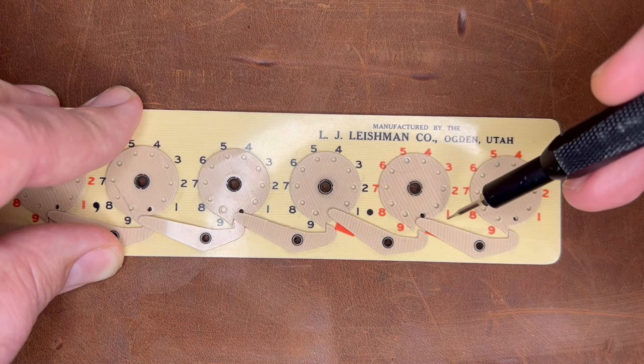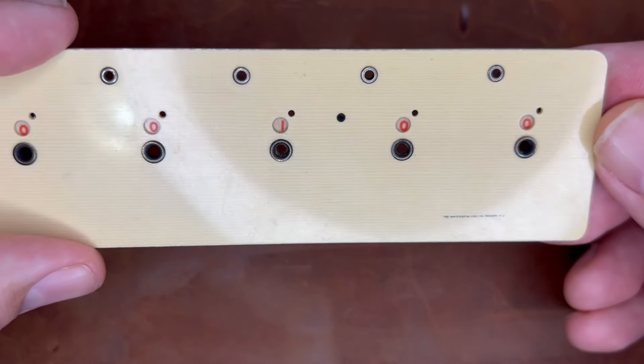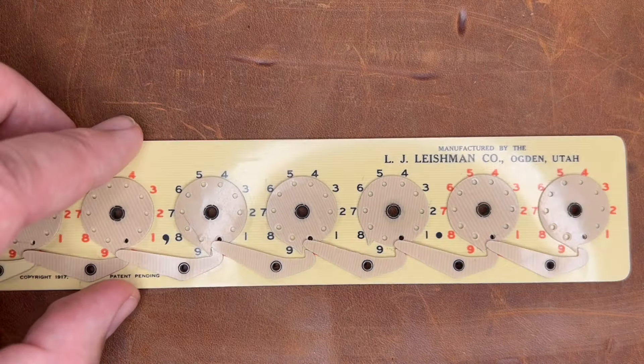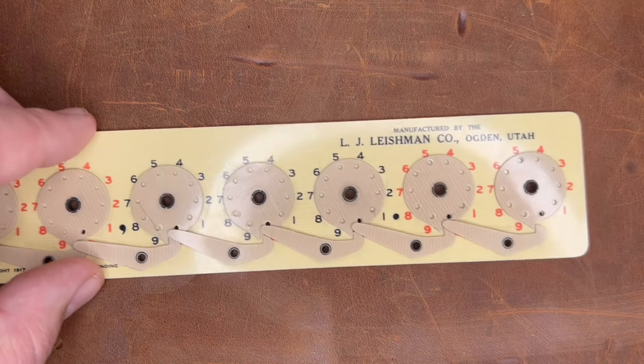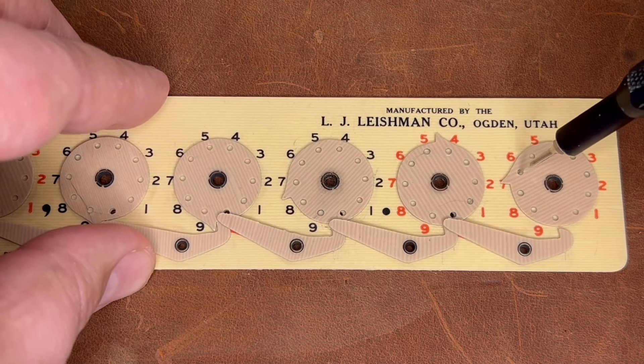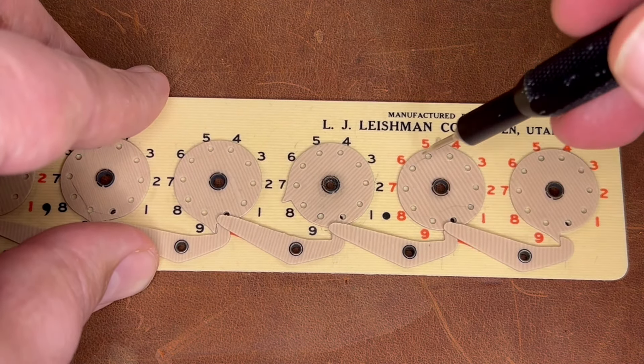It shows a red square that says it's time for a carry. So you do the carry and it pushes the lever back down to mostly cover up the red spot. Oh, here's another carry. And now if I flip the device on the back, you can see there's the answer: 100. And that's it — there's no subtraction. To reset the device, you would just spin them counterclockwise until the notch is stopped by the lever. What a marvel.